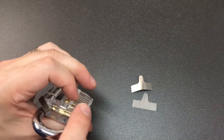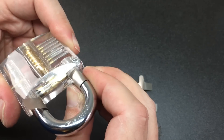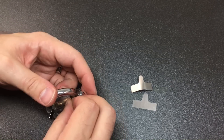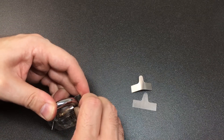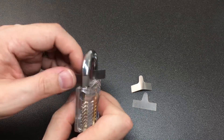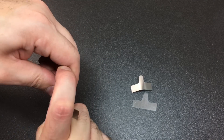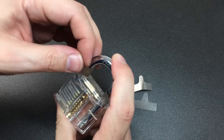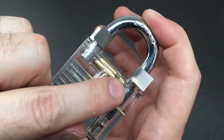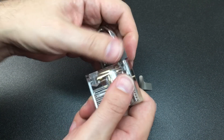Do the same on this side — I normally start where there's a nice gap away from the pawl, then squeeze this together around and gently push down the shackle and try to turn these in. You've got to be careful because these can be quite sharp — not as sharp as you might think, but there is potential to slip and hurt yourself. If you've done it properly you've pushed the pawls out of either side of your lock, and there you go — you can open it up.